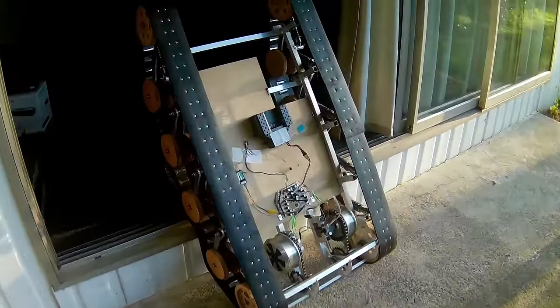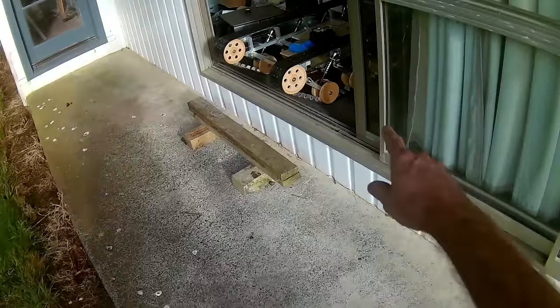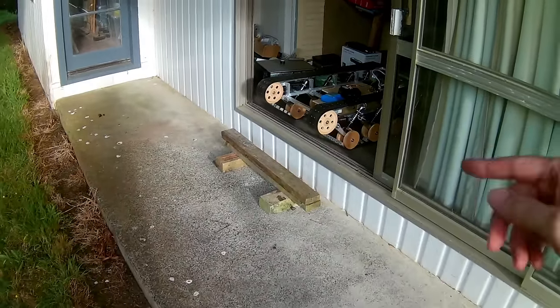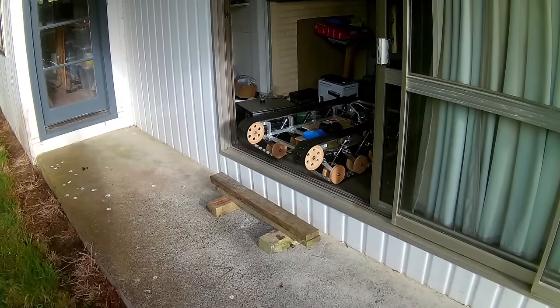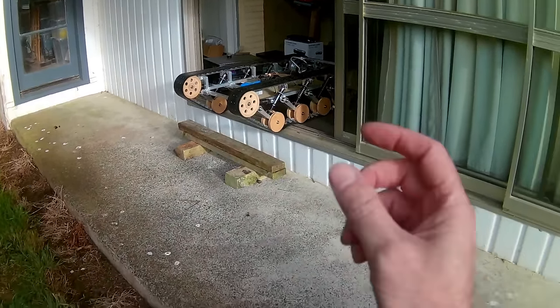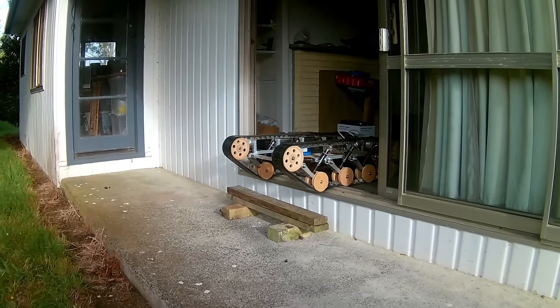Okay, I mean, saves me some work. Okay, I put two batteries in parallel there now. They're charged to 38.2 volts, which is as far as I can get them with the thing that I'm charging with. So we should be able to figure out whether it's the battery that was at fault or something else. And in the last run, one of the teeth fell off, and I had to rivet that back on, but there was no other damage that I could tell.